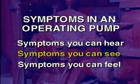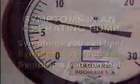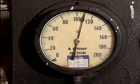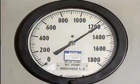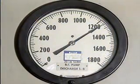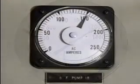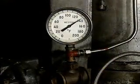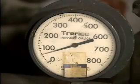Often the symptoms of problems in a centrifugal pump can be seen. For instance, one indicator of a problem in a pump is an abnormal reading, usually a low reading, that can be seen on the discharge pressure gauge. Abnormal suction pressure can be seen on the suction pressure gauge. One thing though, if you see an abnormal reading, make sure that the gauge is functioning properly before assuming that the problem is in the pump rather than in the gauge. On some pumps, you may be able to see abnormal readings on instruments that indicate current draw by the motor, or bearing and lubrication temperature or pressure in a forced lubrication system.